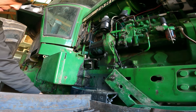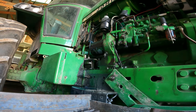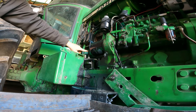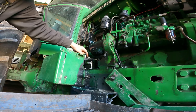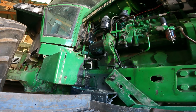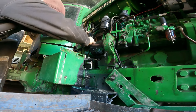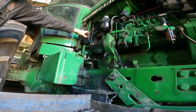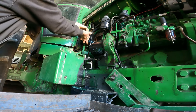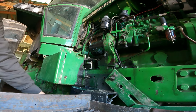I'll go ahead and drain out the filters, and once I've got everything changed I'll clean up where it ran down the side. I was getting a little bit of motor oil, and come to find out the tachometer cable where it screws in was getting loose and spitting a little bit of motor oil - leaching out right there. I got that all tightened up. Now if you have a 55 series or even a 50 series, it's going to have all digital contact, not a cable anymore. Okay, there's that one - now ready for the new filters.